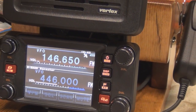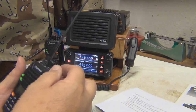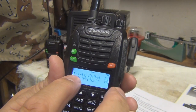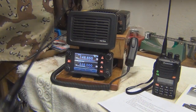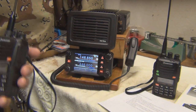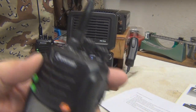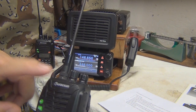To demonstrate this with my radios — and one reason to do this is to be able to use handhelds like this, a simple Wouxun or Baofeng or whatever, around your own house — so you don't have to worry about carrying or where you're at with the base unit; it'll automatically transfer everything. I have the handheld programmed to 446.000, matching this unit, and my test radio is at 146.650, matching the 146.650 here. So I could be anywhere on my property, or within a mile or so, using my handheld, transmit through this on my larger antenna to get out to the world, and receive information back on the handheld rather than being right here.